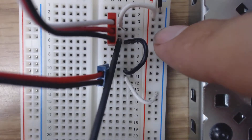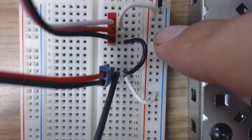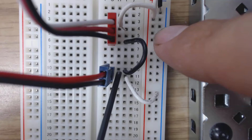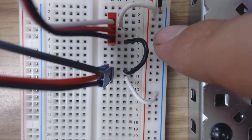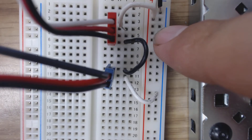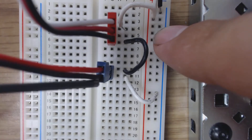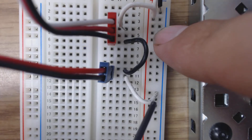I am plugged into the right row here for my black wire — I am plugged into row 6 for both of those blacks. And I hop over here and I am now in row 10. In row 10, my motor — this is the 393 motor for VEX — I pick it up on that red wire, it goes through the motor, comes back on the black wire, and now I'm in row 11. I pick that row up and take it over to my negative side.